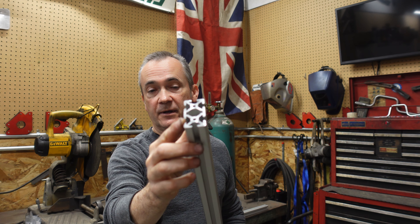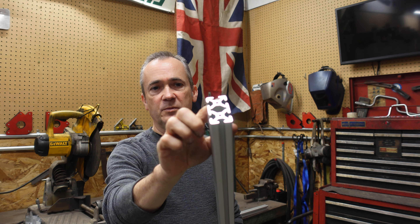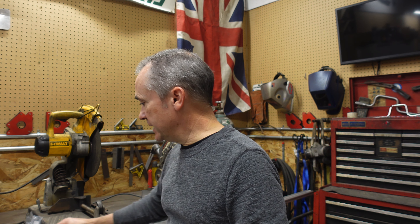There are different types of fasteners. This is a roll-in type — it has a rounded edge that allows you to drop or roll it into the slot and move it along. The advantage of the rounded style is that if you have this assembled and captured on one end, you can still roll one in without taking it apart. This one also has a set screw that, once it's in place, fastens it down so it holds. It takes just a quarter-twenty bolt — this one happens to be a button head cap screw — and whatever you're fastening can be any length.